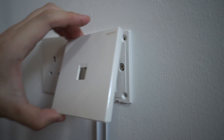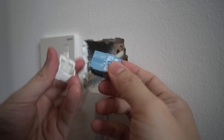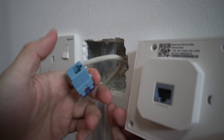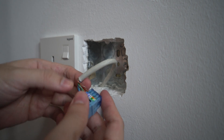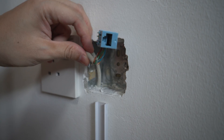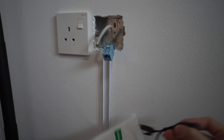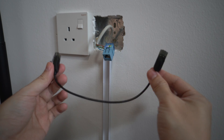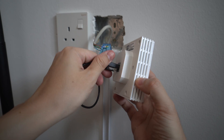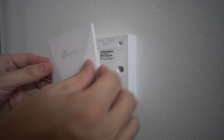Usually the opening is below. Detach the cover away from the cable inside. The idea is to have this cable connect to the back of the AP. To do this the proper way you have to remove the whole connector and use an RJ45 crimping tool to attach it. I'm going to use the easy way out by getting a super short cable to connect both ends — this is a 25cm CAT6 cable from Ugreen. You want thin cables and small connectors so you have enough space to stuff everything inside.